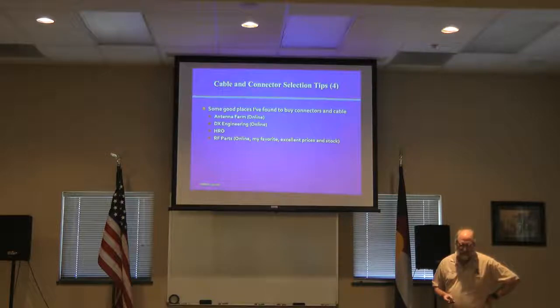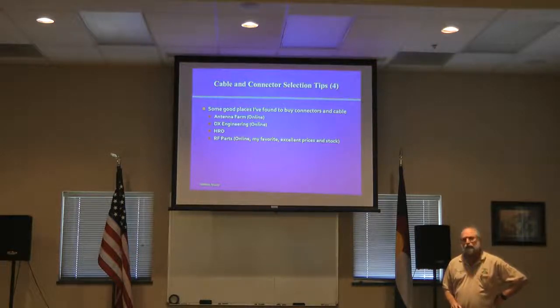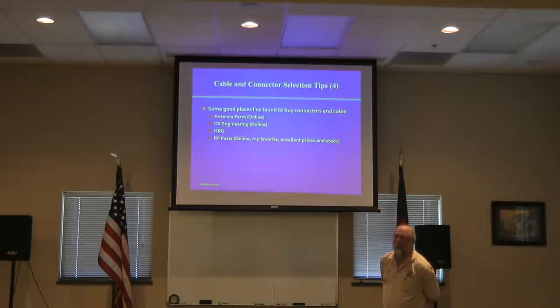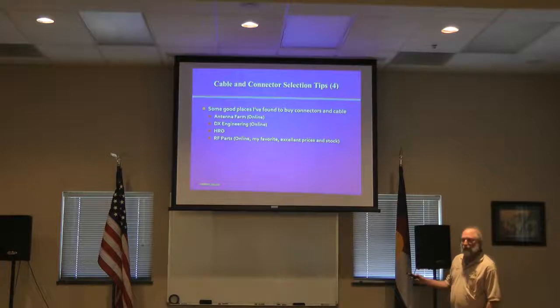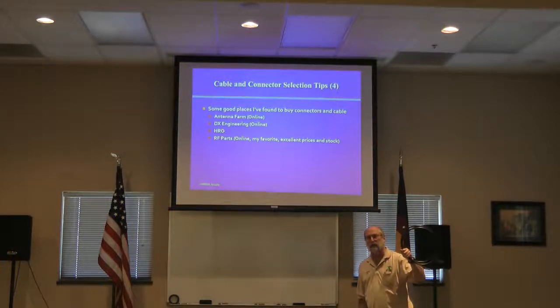An alternative about as good as, if not better than, Antenna Farm would be RF Parts. They're out in California and have an unbelievable stock of cables and connectors, with absolutely the best prices I've ever seen — though you may have to buy a dozen connectors to get a better price. For a UHF antenna up on my chimney with a long run, I'll go to hardline at UHF to keep the loss down, since even LMR 400 gets a little attenuated when you're looking at 75 or 80 feet up.